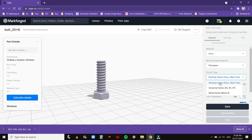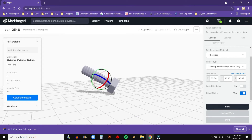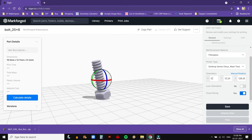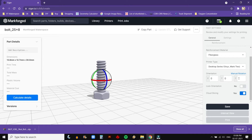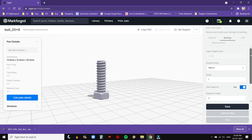Select Mark II in printer type. You can also change the orientation of the object to a specific angle if required. The highlighted ring represents the plane in which the object can be rotated. Move the mouse to change the angle or type it manually. Layer height determines the thickness of each slice when converting your part to a series of printable layers. You cannot change this if you are using fibre reinforcement.